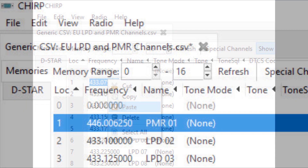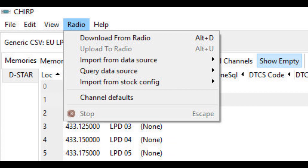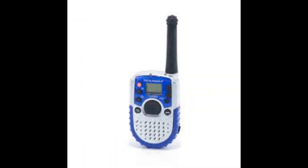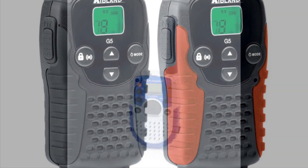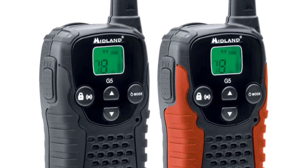At this stage I also name each channel PMR 1 to 16. If you've got a radio with an LCD display it will come up and display the correct channel number. When you've finished putting the frequencies on your 16 channels, just go to Radio and then Upload to Radio, and your radio will be programmed. Once done, your Baofeng radio will work just like any other PMR public radio. One thing to note: these Baofeng radios are not type approved, so in theory they are still technically illegal to use. I've never heard of anyone getting in trouble, but just bear that in mind.